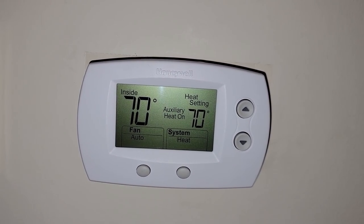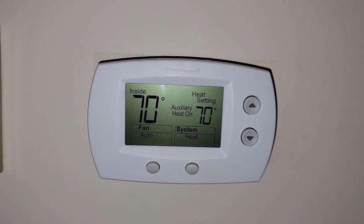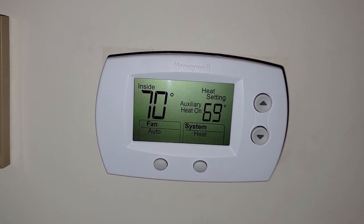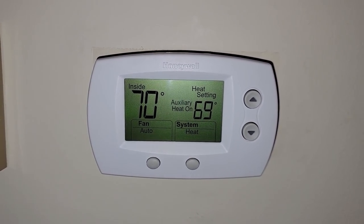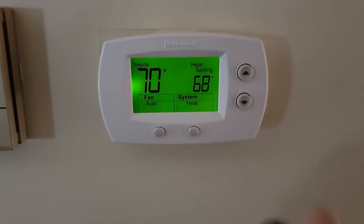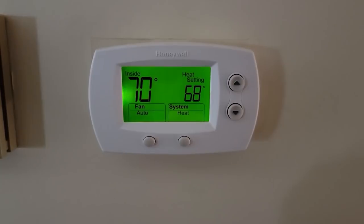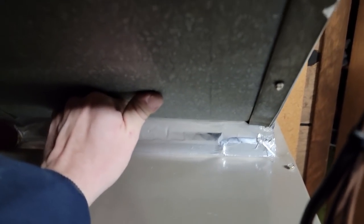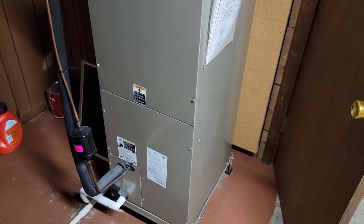Let's go down one to see if it all shuts down. It took forever but the thing finally shut off. The fan - it appears everything is shut down. That'll tie into the heat pump section - making sure nothing's running down there on the heat pump or on the air handler. I do not hear the electric strips humming, do not feel any heat.